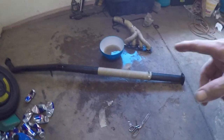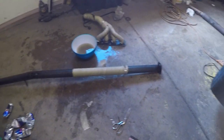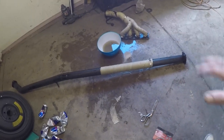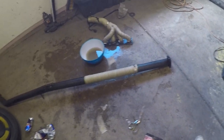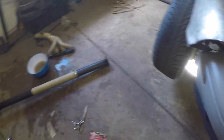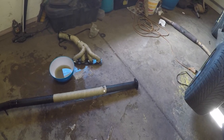Got the header wrapped, and I also put the rest of the wrap I had left at the section where it goes underneath the tunnel and the shifter, because it tended to get kind of warm since I don't have carpet in the car. That is done. I'm gonna let that sit up for a minute, put the header back in, mount that to the header, and then I can finish the rear section as it comes out the back.